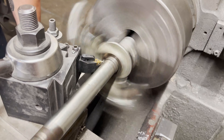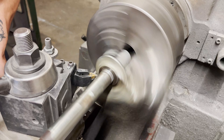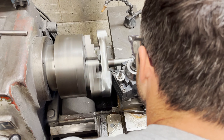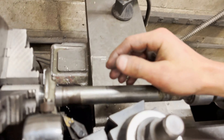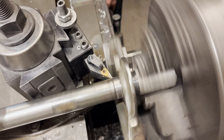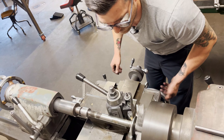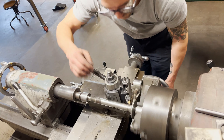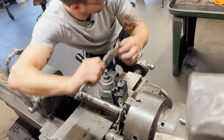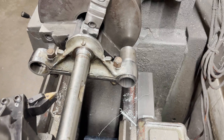I took a couple of rough passes and I'm going to measure this diameter to see where I'm at, then turn the rest down accordingly. Yeah, it was just enough to clean up that piece right off. Sand it, clean it up a bit more, and then test fit.